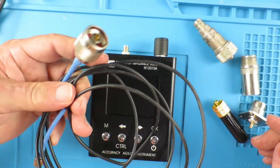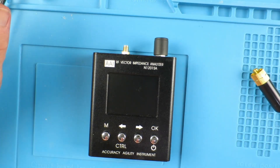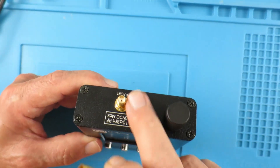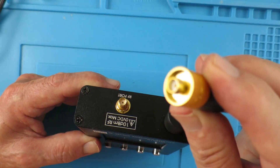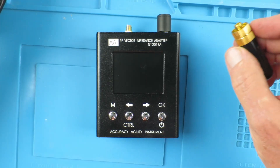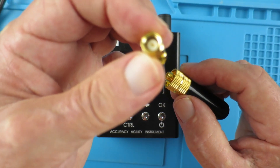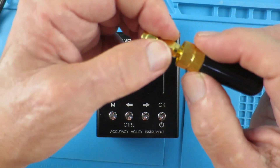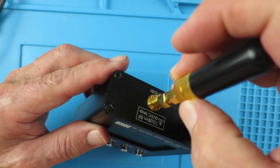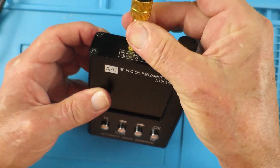This Frankenstein's monster is an N-type to SMA adapter, and we've got all this history here. Obviously if we want to test this antenna on my new device, this is reverse-polarized, so it's a socket - and so is this standard SMA port. What we need is an adapter. This little guy is SMA at both ends, so it will go into the reverse SMA there, and being SMA female on the analyzer, I think we can sort our genders out. And we're good to go.